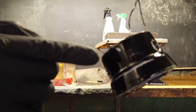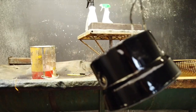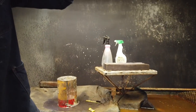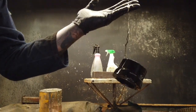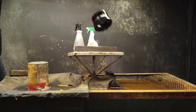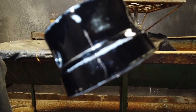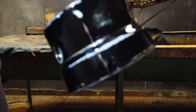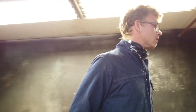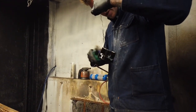That area there — I don't know if you'll be able to pick it up on the camera — but you can see there's a water break there. If you were to chrome over that, it will stay exactly how it looks there; it won't chrome over it properly. You should be able to see the tiny droplets where I'm looking now. With the lighter shining, there's a break there and it's not properly cleaned. Is that grease sitting on there? No, it's just the heat treatment that wasn't done before — it doesn't bond properly. Those problems there, you should just run the torch over again.